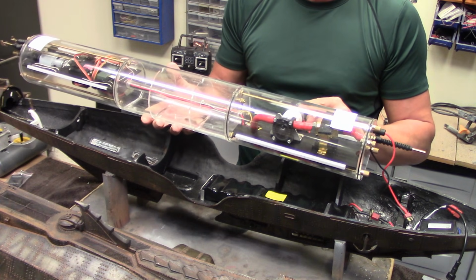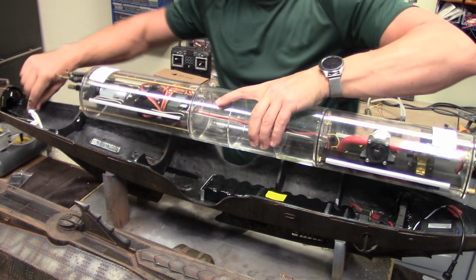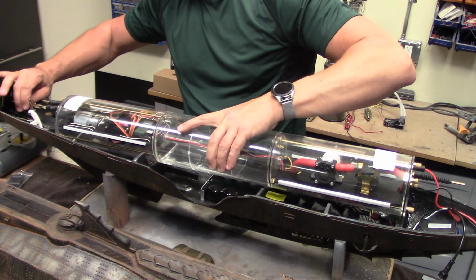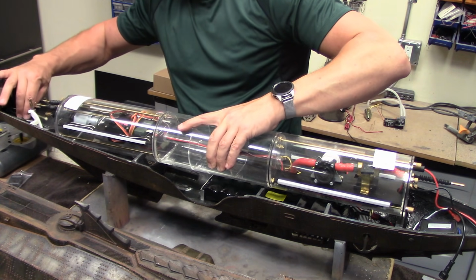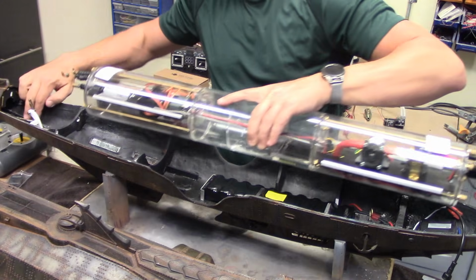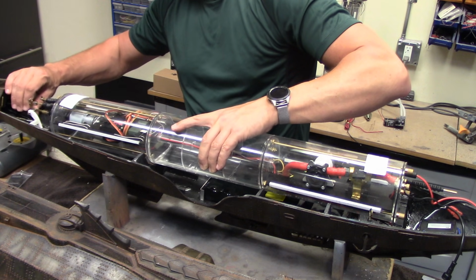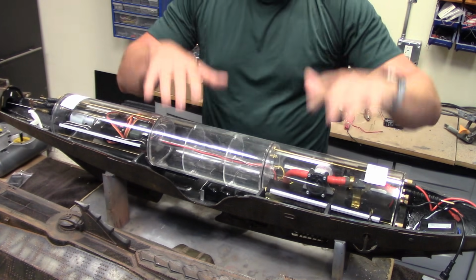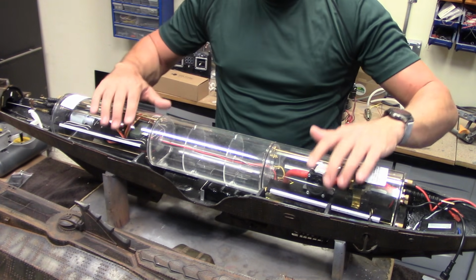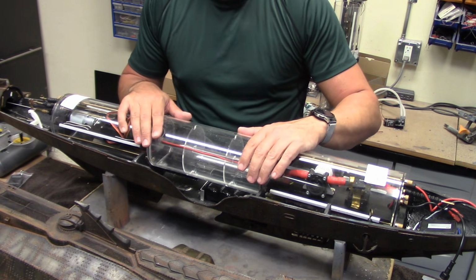Obviously the pump compartment goes in the front and the drive compartment goes in the back. What we're going to do is grab the drive shaft. We're going to slip it into alignment with that rear dog bone, and you can see these brass wheel nuts, and they go into two holes. So we're basically going to slip those in place, make sure that our drive shaft is aligned, and then push the cylinder back. Once you do that, the whole cylinder basically just drops in place as you just saw. So it is now completely aligned and locked in place so it can't rotate anymore.